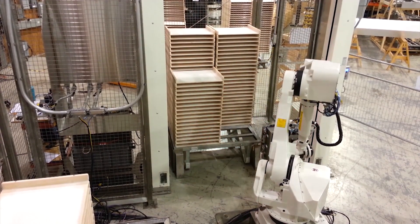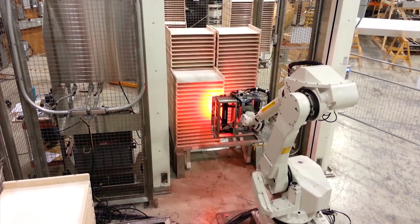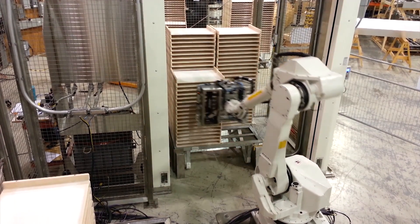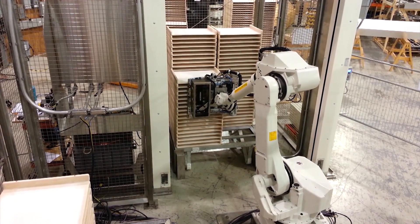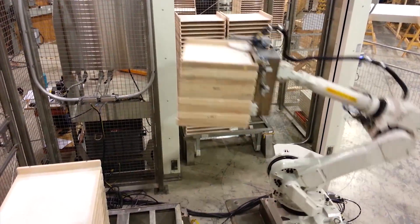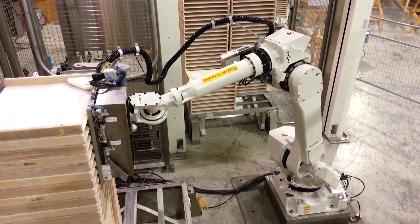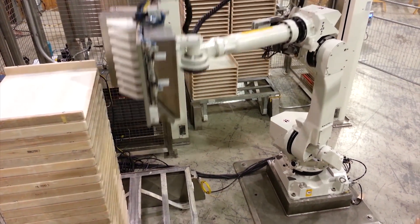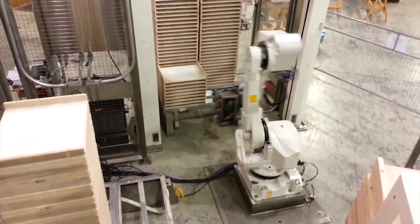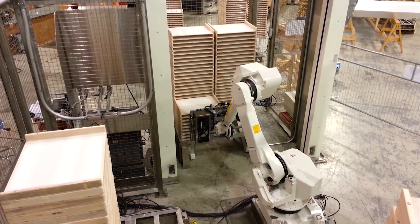The trays are such that they are not completely vertical stacks, therefore the robot must adapt to the position of the stacks based on both a 2D and 3D LiDAR vision system. The system first takes a 2D snapshot of the stack in order to get the rotation of the head to match the stack. The system then takes a 3D image of the stack to gauge the distance from the robot in the other dimension.